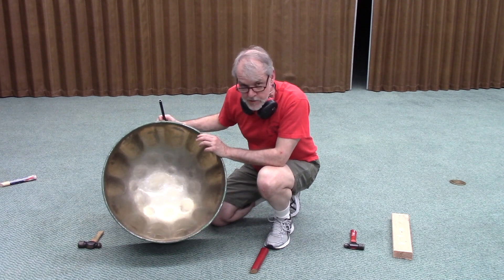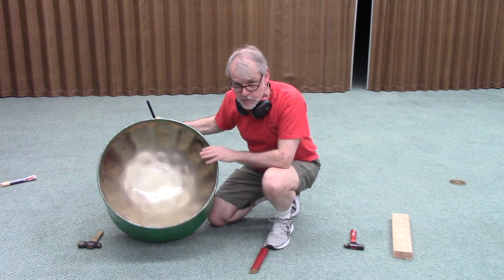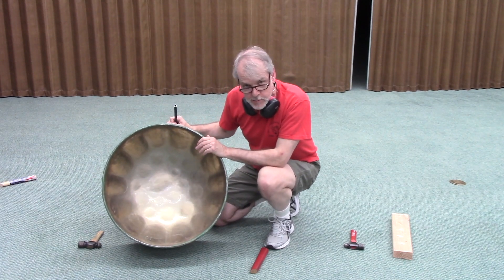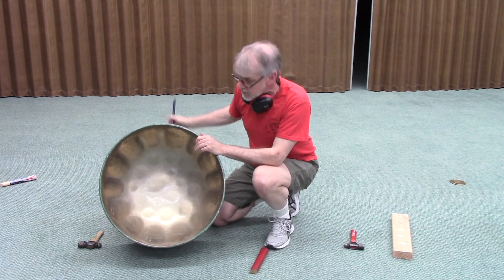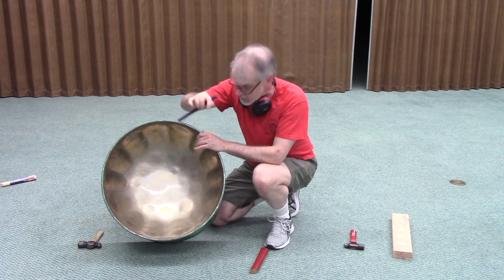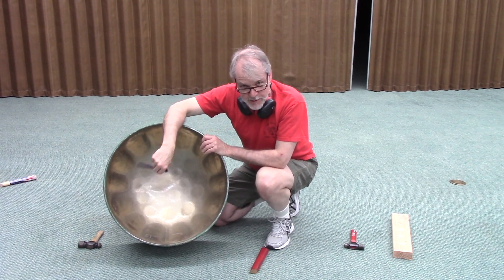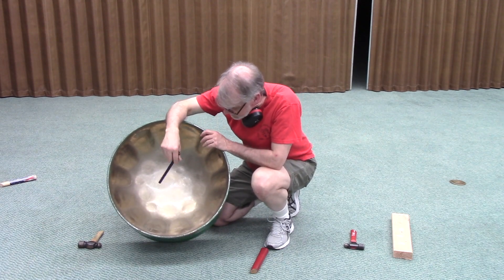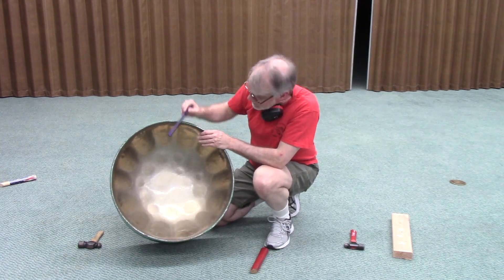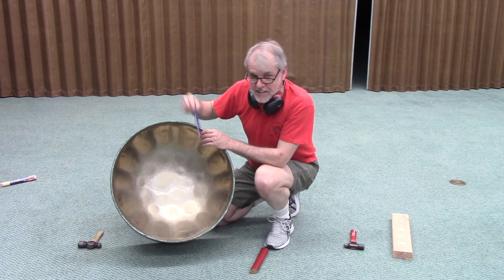I'm not done with the process yet, but after about an hour of working on it, you can see that all of the notes have some contour in here. They've all been popped up from the bottom, and that's something I wasn't able to do before I cut the skirt off. Now I've been able to go in and pull up all the rim notes and give them a little bit of shape, and I was able to find all of my notes that are inside the bowl and give them some shape as well. I still have more smoothing to do before we can burn this, but one thing I noticed was how independently each of the notes have become since doing that stage.